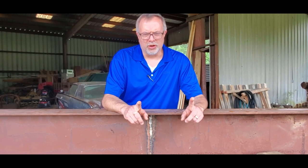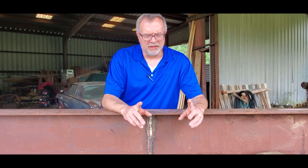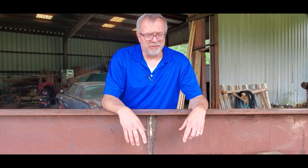Next we'll get into welding on those carrier plates that we drilled the holes in onto the underside of the beam, and some 2x2 angle for lateral support, and that'll be the next phase in the beam, and then we'll be ready for paint and try to figure out a way to hoist this thing up and install it.